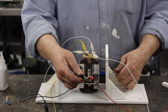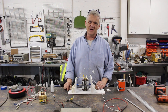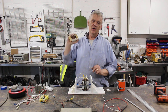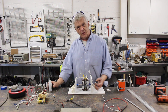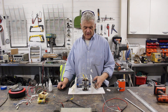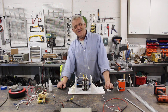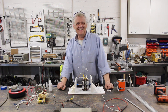Even turning it by hand I'm getting about two volts out of that. A dead simple way to make a generator from a microwave oven transformer — and it performs quite well. Remember: thick coils are low voltage, high amperage; thin coils are high voltage, low amperage — you just make a choice. Obviously you'd attach your input here, whether it's a water wheel, wind turbine, or whatever. Generators are stunningly simple things because they all work on the same principle: a moving magnetic field and a coil. An easy project for the weekend — I hope you enjoyed it, thank you for watching, and please remember to like and subscribe.